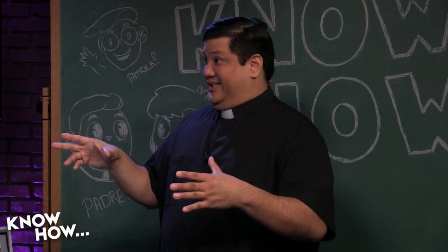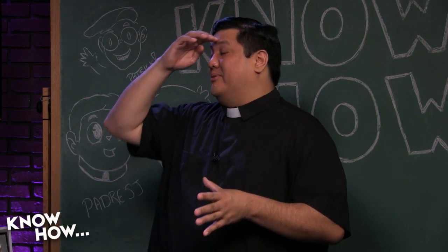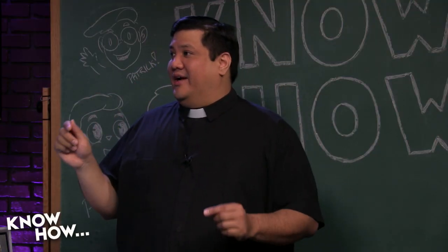Now, actually, by the way, let's go off the rails a little bit. We've been working on the little RetroPie. Yes. The Twitendo to replace the NES Classic that went away. And you know how in the original one, you bought a little device for the safe shutdown, right? Yeah, it was called like the Mausberry circuit, which you would hit the button, it would trip the relay, and then that would send commands to the Raspberry Pi to tell it to shut down. I figured out how to do it with an Arduino. So with a $3 Nano, I can do the same thing.